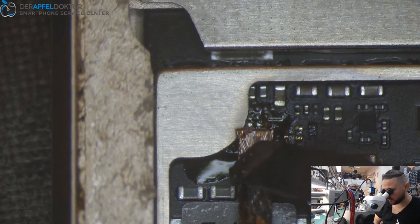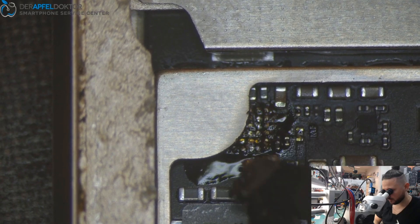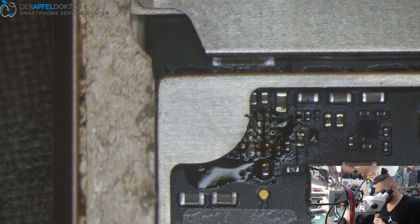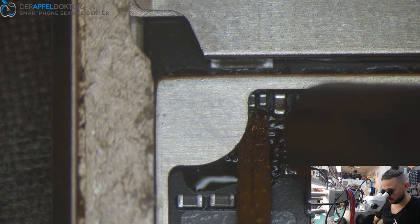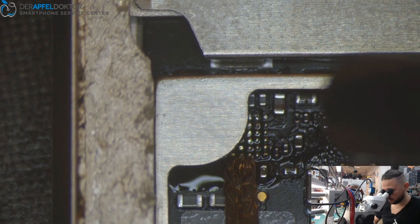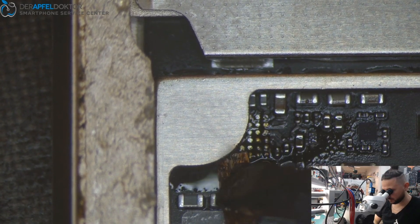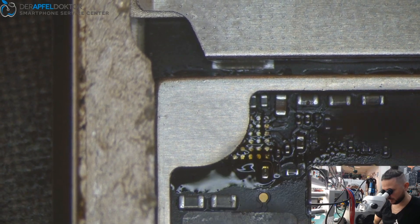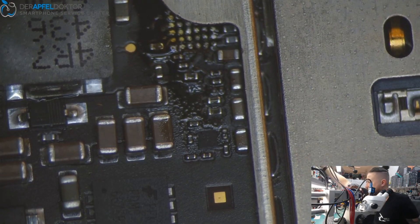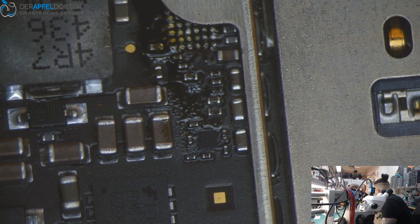I don't want to cut the shield, and if I don't like to do that I have to re-heat again a little bit here. Once it's hot enough, it's much better to clean here — because we don't use preheat, on cleaning we just need a little bit more power to get it really clean. Now a brush — I need contact cleaner, Andy. I need to fill up after this.